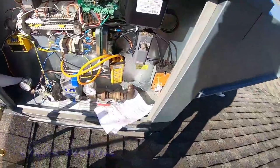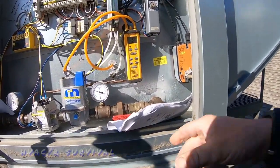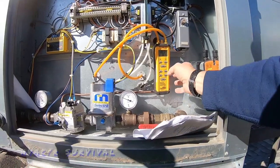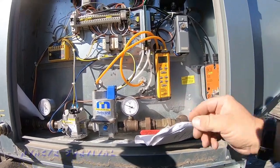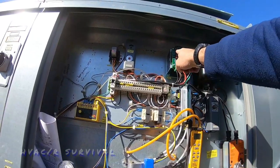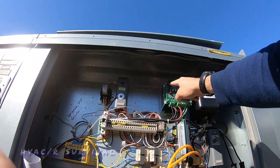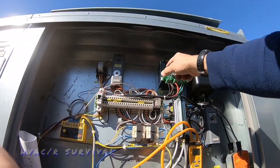We've got a modulating valve here — it's opening right now. Zero on the meter. They tend to have issues when they go from warm to cold. We also have an airflow switch on our readout along with flame alarm and other operational circuits.